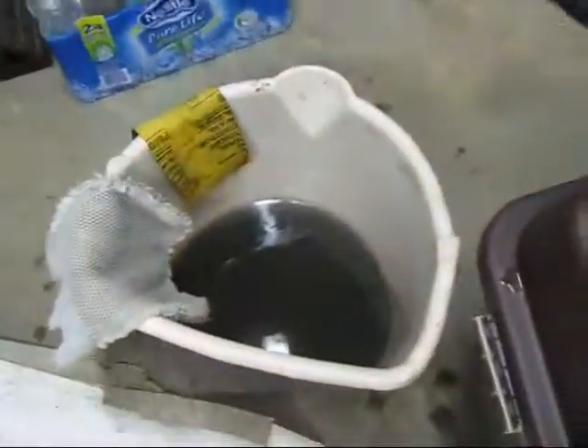I've gone ahead and sanded half. You can see the top half still has its gloss. Hit the bottom half and it's very flat. Just going to let it sit and dry off for a little while. Here's the water from the wet sand. When I'm all done I'm going to get this nice and smooth and then throw another coat of paint on it. I want to get all the loose paint off so it doesn't start flaking — I want to make sure this stuff is going to last a little while.